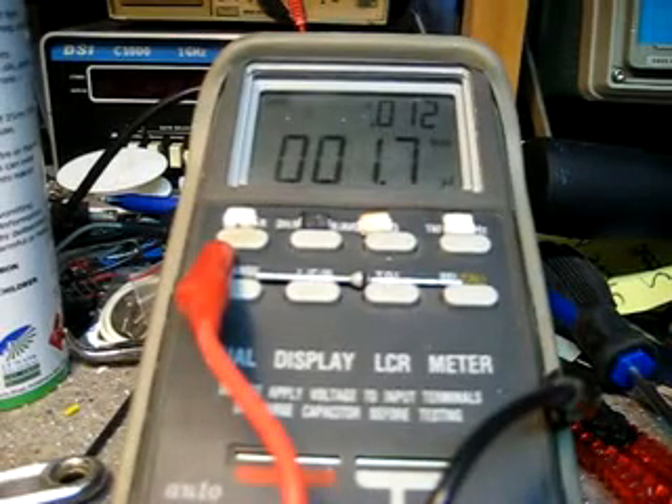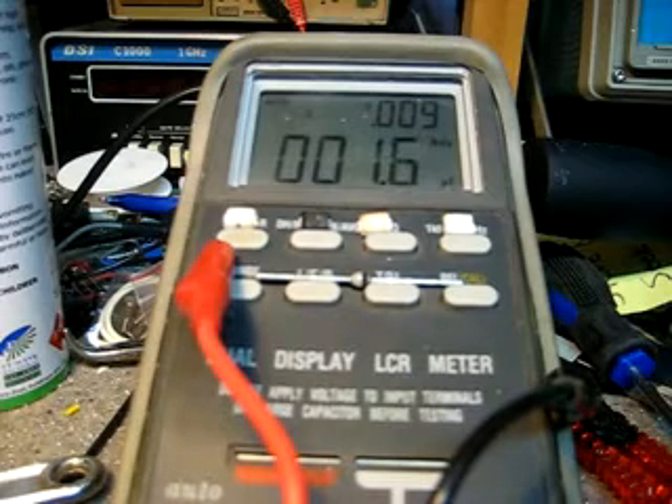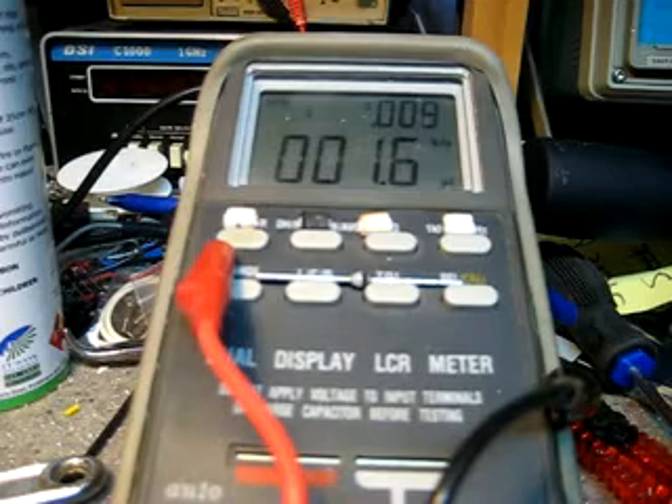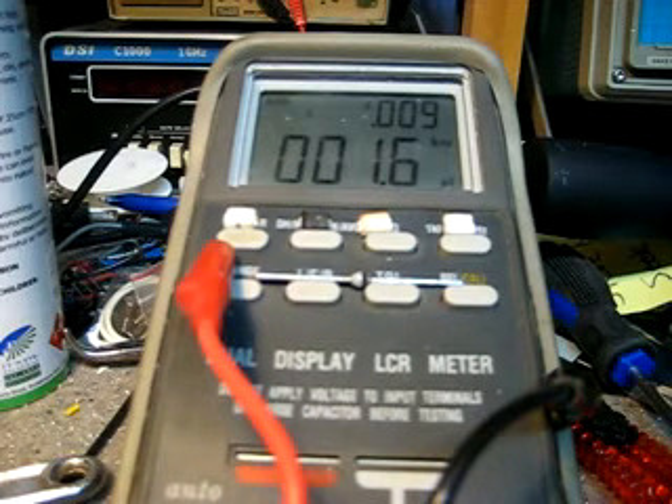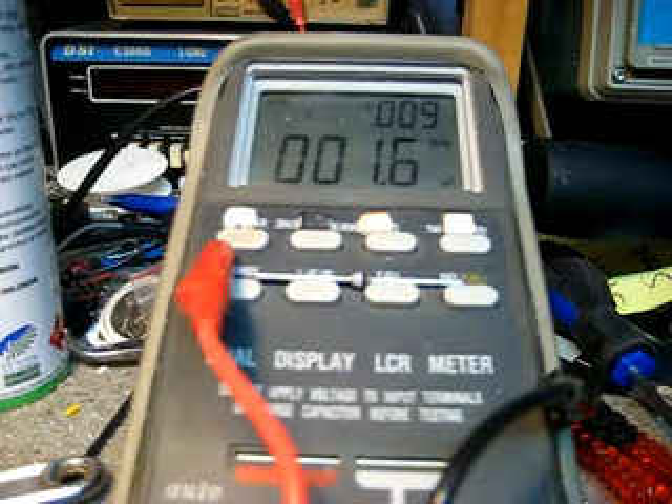Good day all. I'm going to show you some differences between diodes out of the transmit section of the Minelab detectors. These diodes isolate the transmit power FET from loading the receive amplifiers or receive circuit through capacitance. If you have two capacitances in series they divide, and with a small capacitance it wins out. So the diodes are basically there — they're usually maybe one or two hundred picofarads, and the output capacitance of the FETs could be up to five hundred or so depending on the FET.